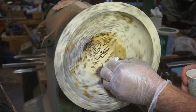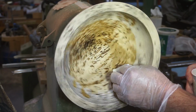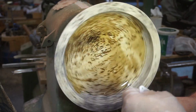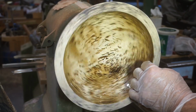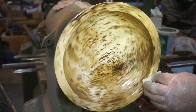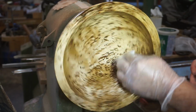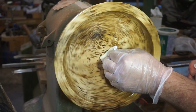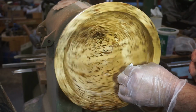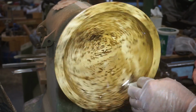Now, when it comes to resin work and non-functional work, I don't have a problem using this wood bowl finish. Actually, I wouldn't have a problem using this wood bowl finish, period, for salad bowls, because I'm still a firm believer that any clear finish when fully cured is food safe, including this wood bowl finish. And General Finishes has stated basically that it's the same finish for whatever reasons. I'm assuming it has to do with legal. They've taken the food safe tags off of the can.